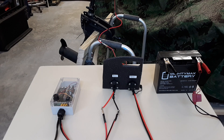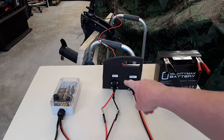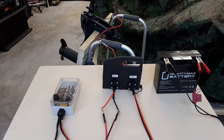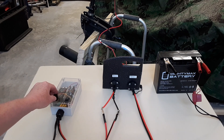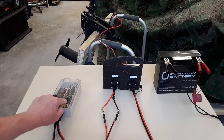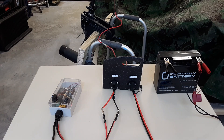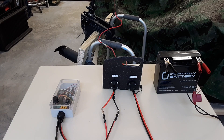This is my test setup. I'm using a PWM mounted in a box from an earlier project, running jumpers to my mock-up where you can see I have the SAE 10-gauge sidewall connectors labeled 'battery' and 'motor.' Those are also jumped to the trolling motor in the background, with my battery as the power source. I'm turning this on now — you can see in the upper left corner that the prop is turning, confirming the circuit is good.